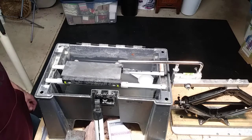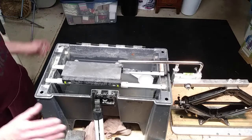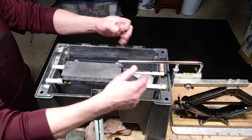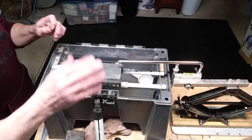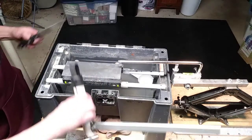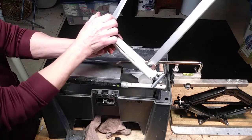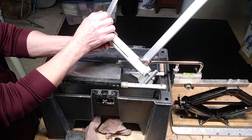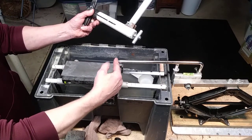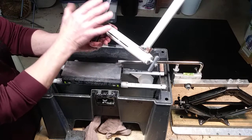This is really mostly just for really expensive knives or a whole bunch of cheap ones. If I'm going from the belt grinder, I can literally set the belt grinder up, turn around, micro bevel, turn around, micro bevel. And it doesn't matter if I set this up at 14 degrees for this knife, something with a bigger blade is only going to be off a degree or two. So they all fall in pretty much the same. I can just put 2 fingers here and I know I'm going to be close on every knife pretty much. Only if there's a really big difference is it an issue.